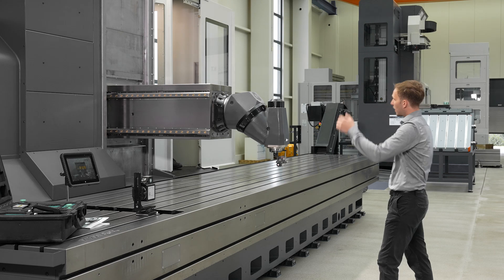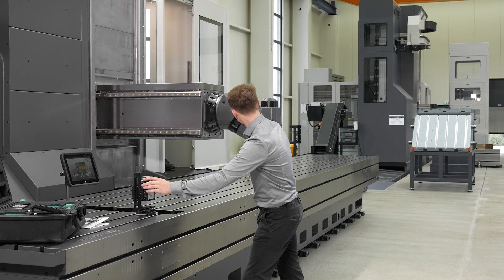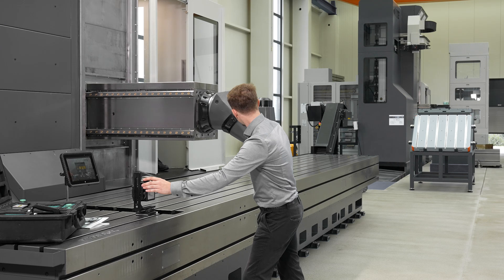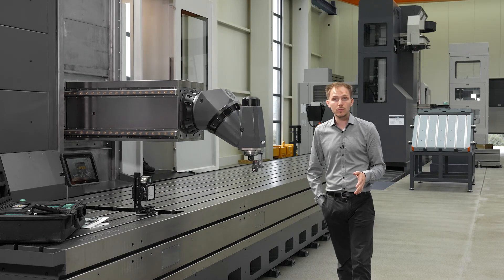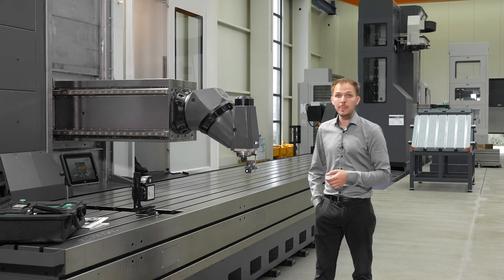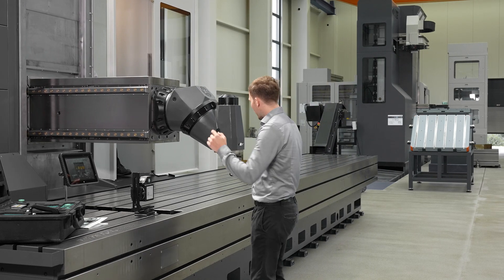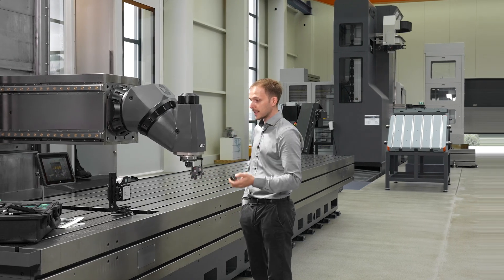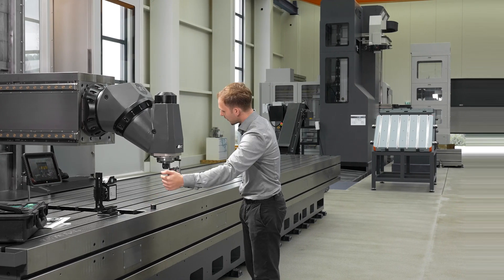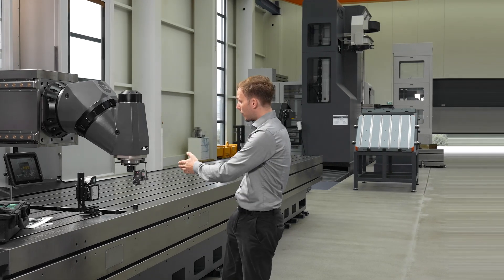Please go back — I just align the distance meter a little bit. Now the rough alignment is already finished. We can turn to the software for our fine adjustment. We release the center cap, because now the laser beam goes directly into the PSD sensor in the R540.